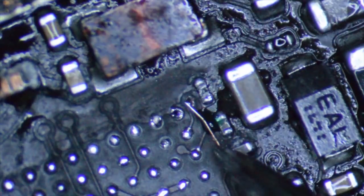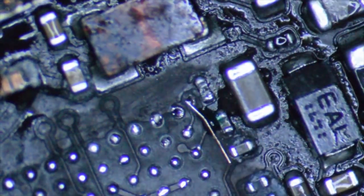I'll make sure that's sitting down flat and put this under a fluorescent lamp to cure — it doesn't take too long as long as you don't put it on too thick. Once your solder mask is cured, you've got something to hold everything together, which is nice because if it becomes detached you can just put some more heat on there and stick it back onto the pad without everything floating away on you. This stuff comes in really handy. I've looped it around to the pad we want to get to, so we have a bit of extra length — in case this thing gets flexed, it's less likely to break the connection.